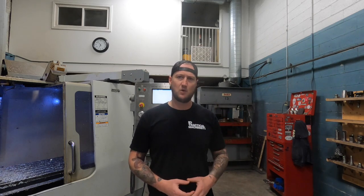If they only really need a part made of aluminum and you're trying to sell them on something they don't need, that's over-engineering. It's gonna be detrimental, because not only does working with a more difficult or more exotic material take more time and beat up more cutters — different grades of stainless are hard to tap, and so on — at the end of the day, unless you're just building it for yourself, this is something that somebody is going to have to pay for. If right off the bat you're selecting something that's gonna make that job 10 times more expensive than if you had done it in a cheaper, more available material, that job's gonna be a non-starter.